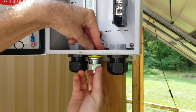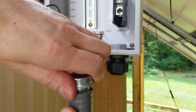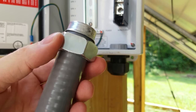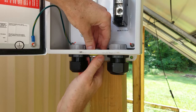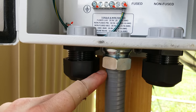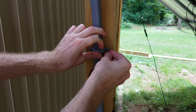For attaching this conduit, I take off the bottom nut and set these pieces aside. This fitting has coarse threads that just thread into the steel. Once you've got that threaded in, you'll notice how the insulation from the conduit goes up underneath the lip of the fitting piece. One thing to make sure of: put the nut on first. I neglected to do so and had to take the piece back off — which was not easy — to put the nut on and then put it back on. So make sure this fitting is tightened down first, then insert your conduit and tighten down the nut. You want to make sure the conduit is not loose so it's forming a watertight seal. I also really should have put this fitting on first before putting the two black fittings on.